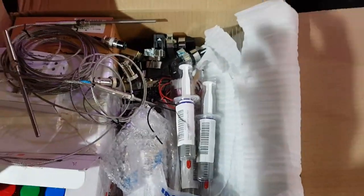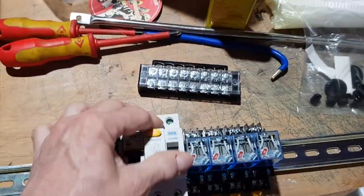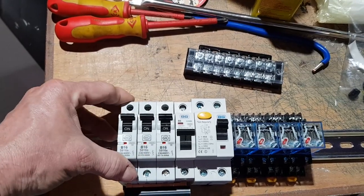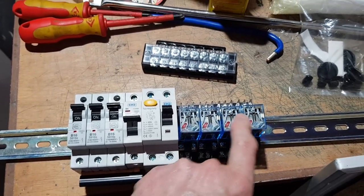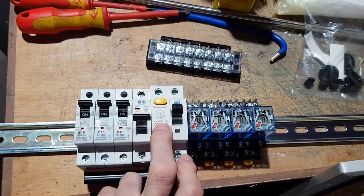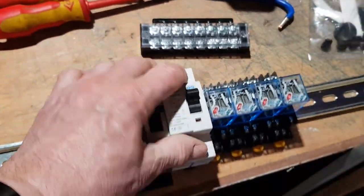That's mostly the control panel components, along with some terminal bus bars which are quite handy. I've got an RCD main, then three MCBs for the heating elements — two for the boiler and one for the HLT. The pumps are going to be run off relays, which is probably good practice: three pumps, three relays and a spare, running off the 6A MCB. Technically with all that running we have far more than this, but we are within acceptable margins so the RCD won't blow — I hope.